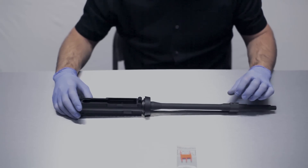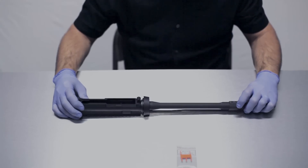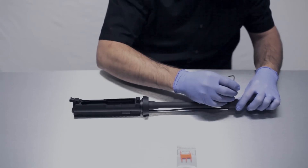This is going to let the pin that we put in the barrel drop down, and now it's going to provide us an alignment feature between our gas block and our barrel, so we now have perfect alignment between the two components.